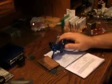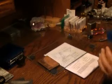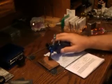The reason I'm using 1200, I would go faster since I'm making a video, but I also don't want very deep scratches in this thing because we're starting to get to the point where if we overcut, there's no fixing it. If we overcut, one way to bail out is to go ahead and make them all the same. The other way is to ignore the one that you messed up and finish the stone. Finish the stone right. Know you got a goof in it, and nobody else will see it but you.